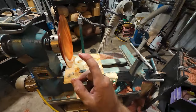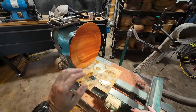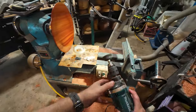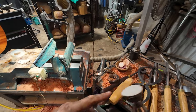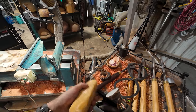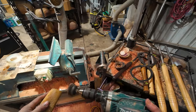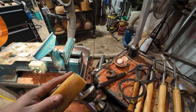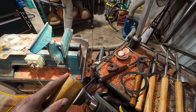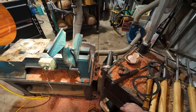One small tip whilst the oil's settling in — look at that, look how gorgeous, that is just a stunning timber. Really tricky to turn — it's got a lot of minerals in it, it dulls your tools super fast. When you are sanding and you see the sandpaper clog up, all you need is a rubber cleaning stick. Just type that into wherever you get your woodturning supplies from. I put the drill around my waist, hold it against me upside down, resting against my tummy, turn it on, and run it across the front — and that will clean the surface of your sandpaper.